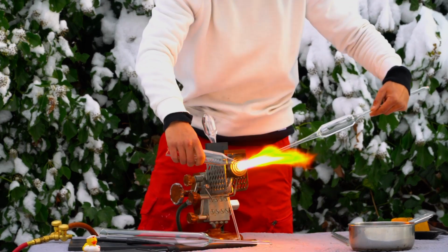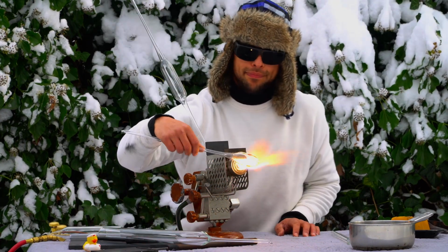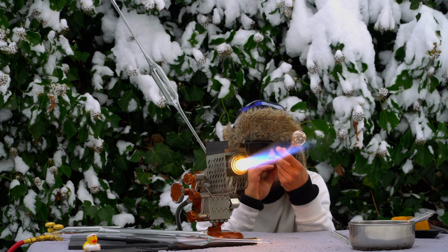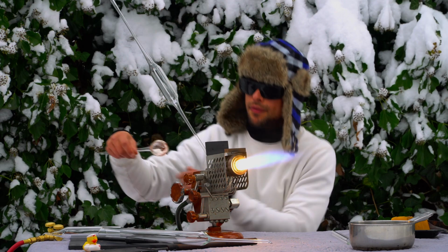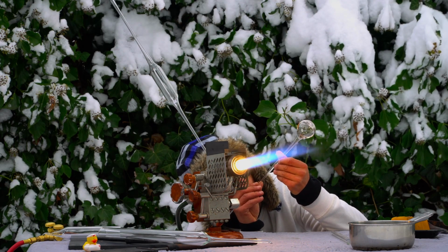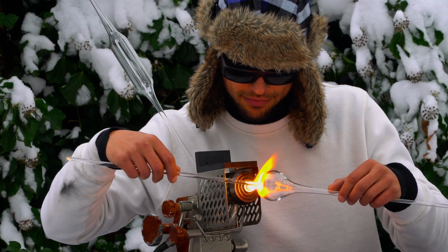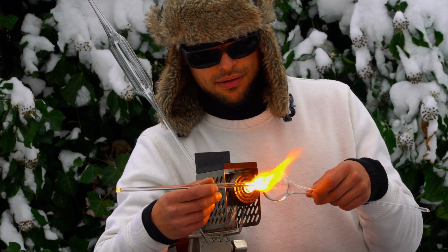Alright, and we've got both pieces prepped up here. So now I'll just go ahead and start forming the base. We're gonna tilt the glass on an upward angle, build up some wall weight, and also add some air. Here I'm coming in with a 7mm rod and beginning to add my avolio. An avolio is a traditional connection point between the foot of a goblet and the stem.